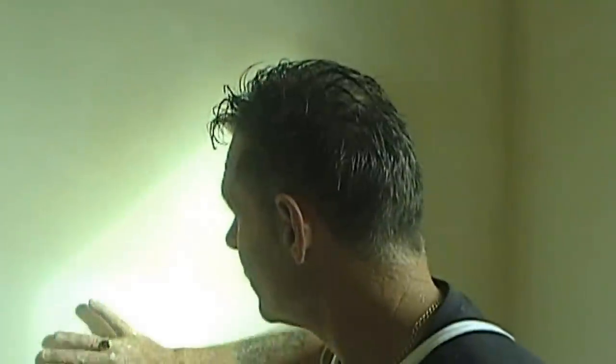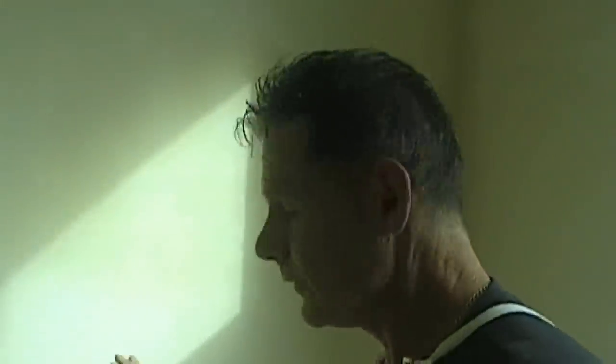You can also, once this is dry, if there's any little blemishes and you need to put filler, this is an ideal surface to lay your filler on, and then possibly sand down if you want to, let that go off. Any little snots or little lumps, you can use your scraper and you just take off any little blemishes that you might see. It's ideal now because this is the time you'll be able to see any little spots and blemishes or little lumps that you want to take off.